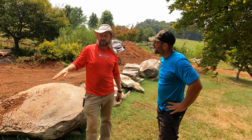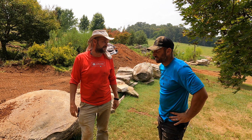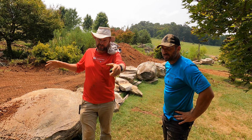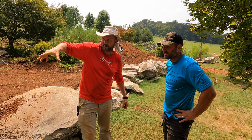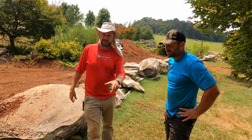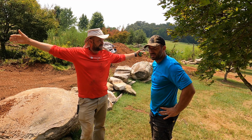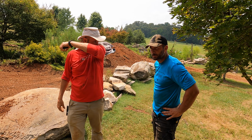And we need the whole width of that stone. It's 5.5 feet, so 30,000 gallons an hour. It's thick water coming over it if we leave the whole thing open. So this has got a kind of a cut in one side. We can spin that and squish that cut over that edge, and then just find something that fits just barely in front of the other edge, and that gives us basically a 60-inch exit ramp out of the wetland.